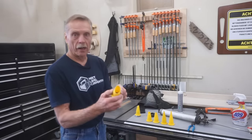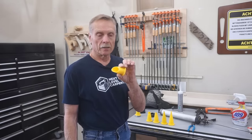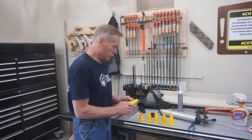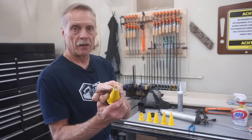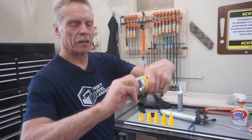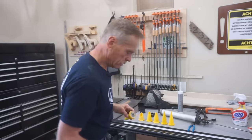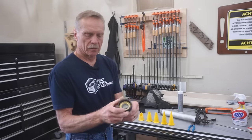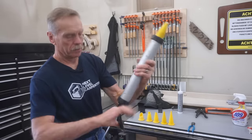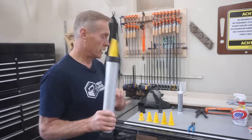I've got a whole range of tip sizes. There are times when I've used a monster tip to lay down a ridiculous bead of sealant — kind of a Hail Mary to stabilize a situation. But for most applications I'll cut about a 5/8-inch hole. The little foil part twists out and the tip slips down into the retainer ring, placed over the end of the foil and tightened down. The advancing plunger then pushes the urethane out of the foil tube and out the tip. It's a great setup.